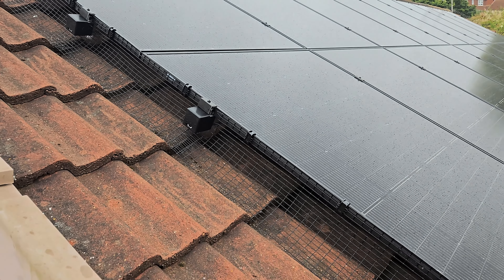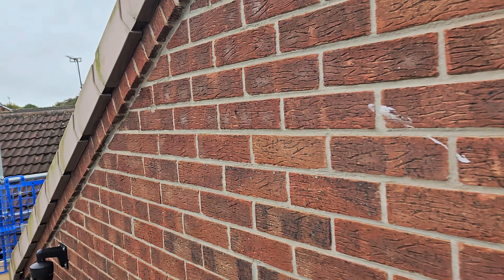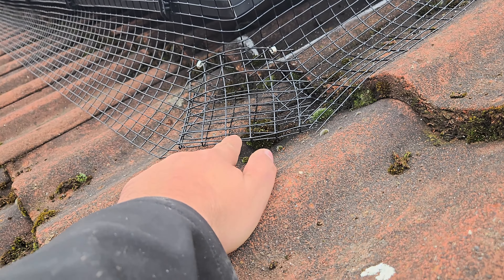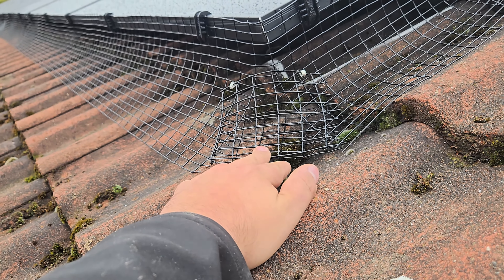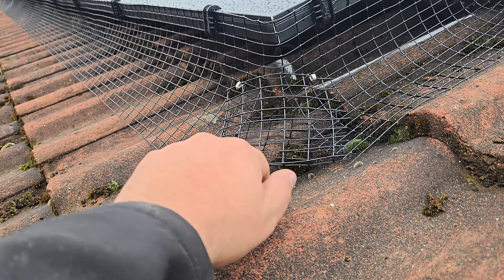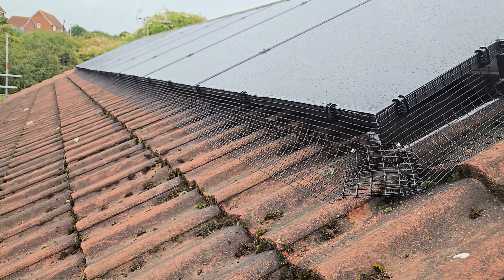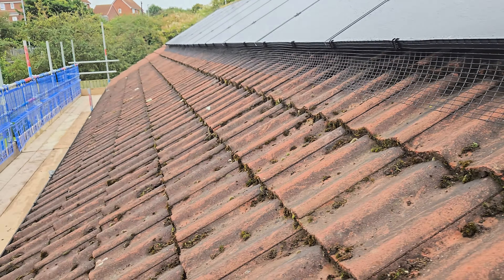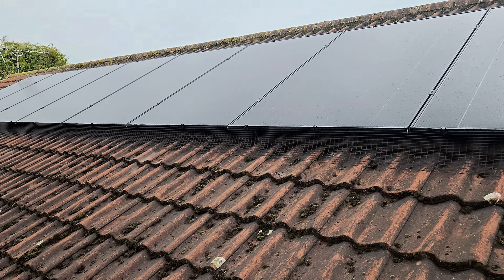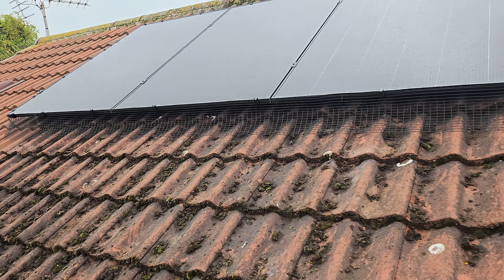The guys have just finished up inside, but I thought we'd show you the bird guard — so that's all on. You can see with the little corner protectors, as you cut this there will always be a little bit of a gap as you break for the edge, and obviously that's big enough maybe for a squirrel or a pigeon to work its way in. So we've filled the corners up all the way around. You can see the bird guard along there — super straight and nice. The panels have washed off. Plenty of the speed clips all the way down — we're happy, more than happy with them.